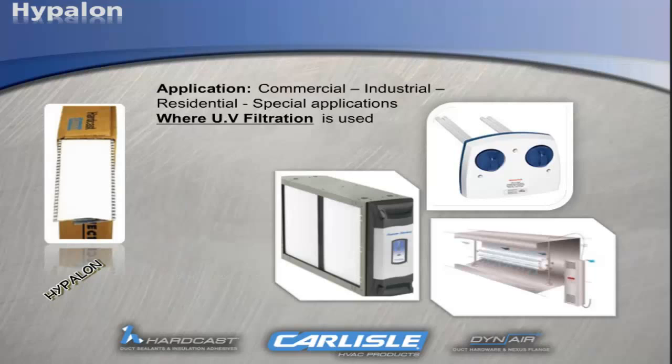This slide shows a variety of different UV filtration devices used in either residential, commercial, or industrial applications. Typically, these systems are installed in proximity to the flexible duct connector. Therefore, the light emitting from them has the potential to affect the quality of the connector over the long term. This is why a Hypalon connector should be used, as it's completely unaffected by UV light.